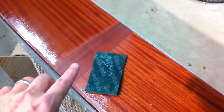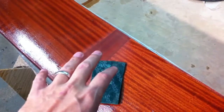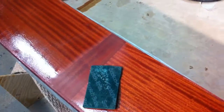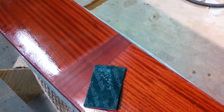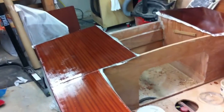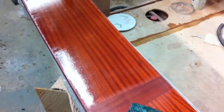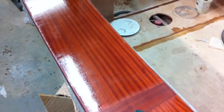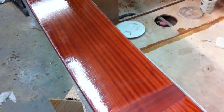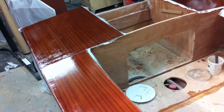So I'm going to go over the entire decking with the Scotch-Brite pad and water, dull it down, and give it a scratch pattern so subsequent epoxy layers can grab on. I'll then continue applying coats of epoxy until I see a much smoother surface with less visible weave. After that's fully cured, I'll wet sand it, and that will eventually prepare it for the final varnish layers.